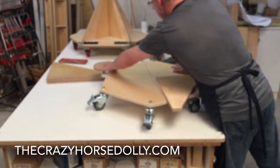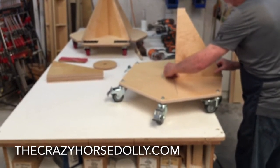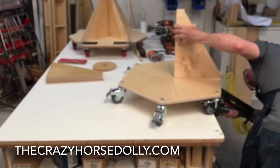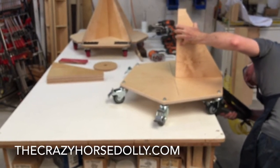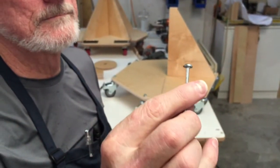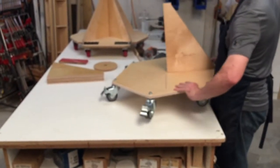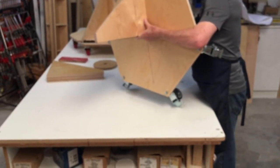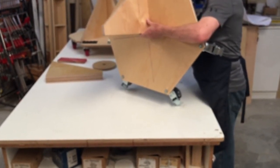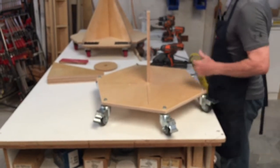I have one of the braces here. I'm going to lock down a couple of these casters so that this thing is not moving all over the place. Right there is where we were talking about earlier — where that indicator mark is on the edge of that circle. That circle represents the tubing, so you don't want this past that. You want it splitting that indicator mark that you put on there. You can line up with the other indicator marks that are on there. Here you see the screw we are using — it is just an installation screw, two and a half inches, number eight, with a type 17 drill point. We are happy with the position of it, looking at our indicator marks, everything looks good. So we are just going to go ahead and drill and get that put in place, and we'll use that as the basis for all the others.